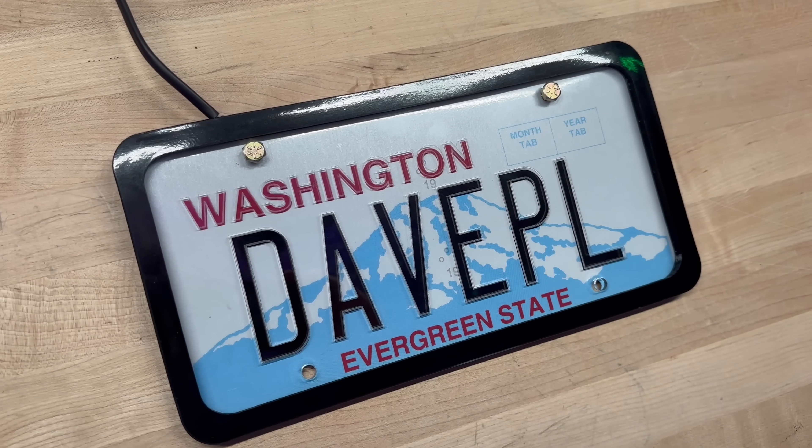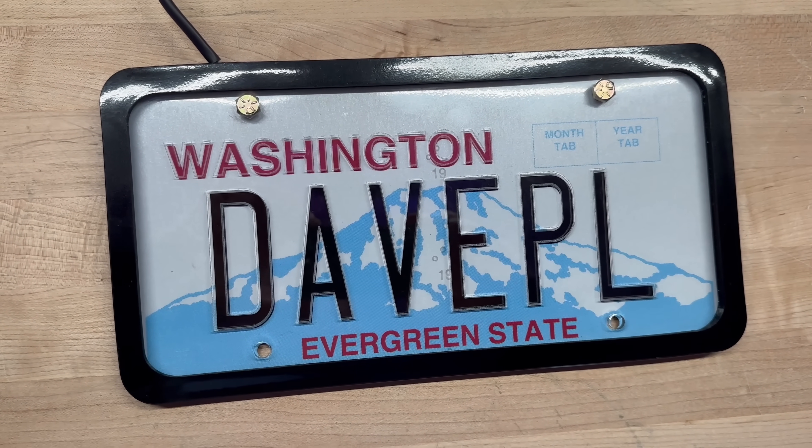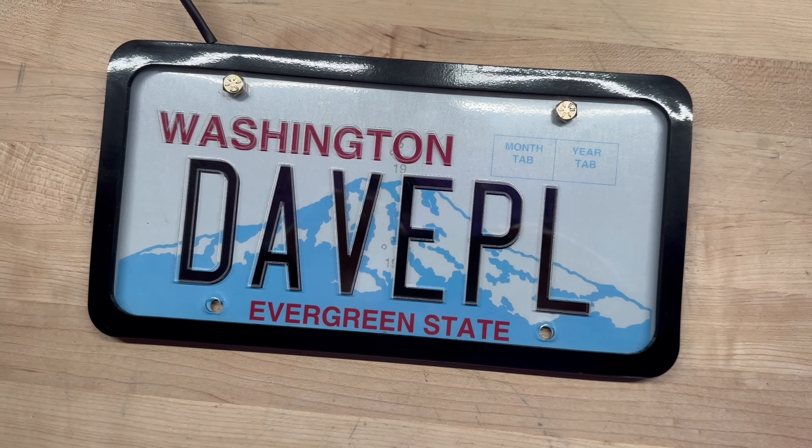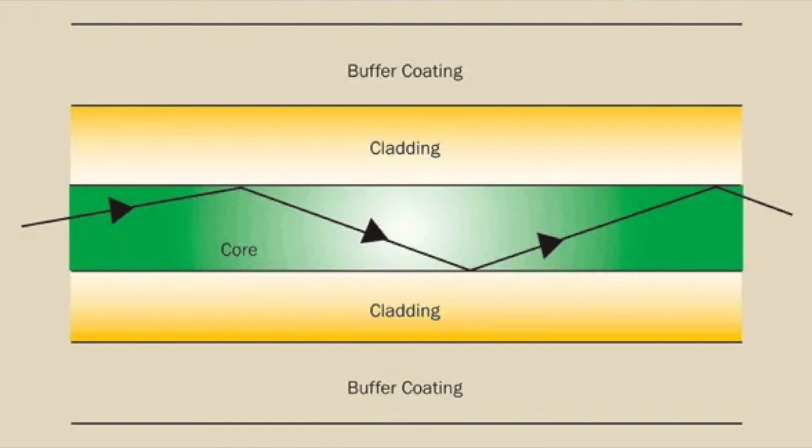Finally, a black color fill has the same effect as turning the LEDs off — when not illuminated, the plate cover, being effectively clear, turns invisible to the naked eye. The magic behind this effect is a combination of physics and a clever use of light's properties within clear materials like acrylic. Imagine the clear cover as a light highway, like a fiber optic tube. Light from the LEDs hits the inner walls of the tube, and because the acrylic has a higher refractive index — meaning it bends light more than air does — most of the light doesn't escape. It just bounces around inside, and thanks to total internal reflection, it stays trapped, almost like it's riding down an invisible tunnel.